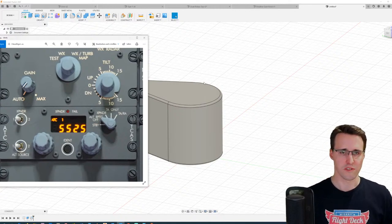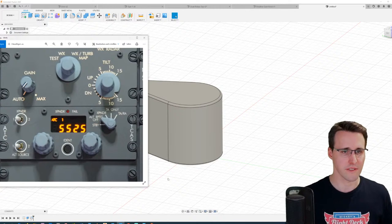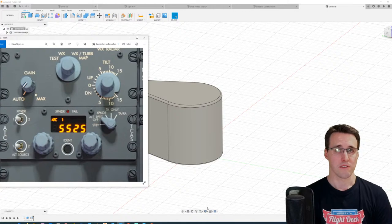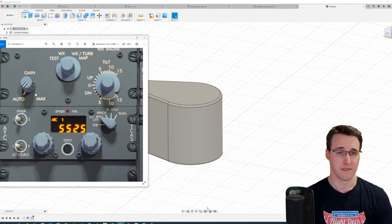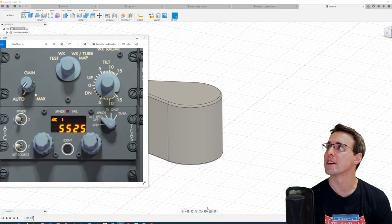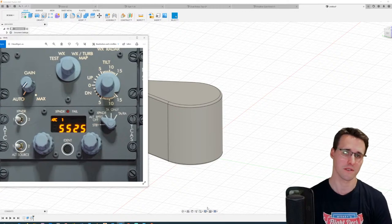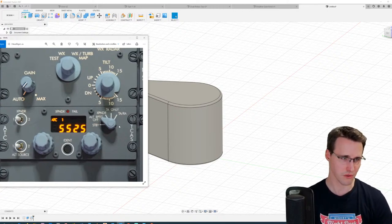And there should be then another shaft inside the shaft of the 12 position rotary switch, which ends on a push button. This can be really hard. Not impossible, but really hard. We will not make the decision today. I have to think a little bit about it. Maybe try out to drill through a 12 position rotary switch, and if it works, then maybe I can come out with a design with a push button functionality.